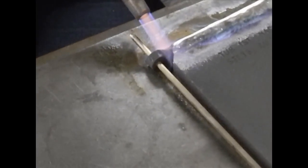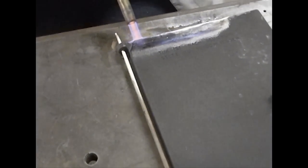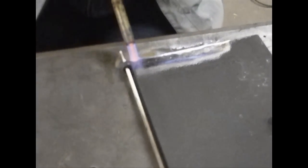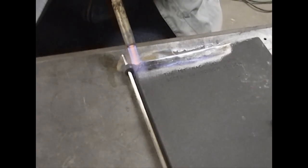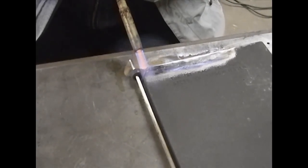I've got the tack done. To make sure that everything is still straight, you move the rod back and forth and you should have very good freedom of motion — and that's pretty darn good. I'm going to have Dana take the torch away, check my measurements, make sure the hinge is exactly where it's supposed to be, and then finish the weld. We couldn't get the tack on film because I needed Dana to keep the heat on the hinge, so we're missing a little bit of footage here and there, but we appreciate your patience.